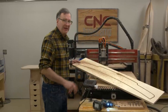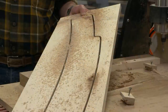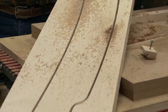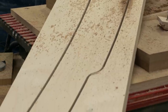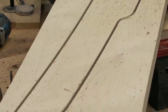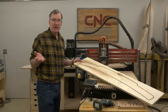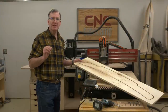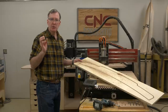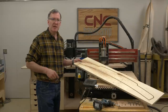There we go — there's our crest rail in three pieces, tiled on this small machine. It's an easy process and it really allows you a lot of flexibility and growth with your machine. What we've done here is create a long piece, but you might also want to think about wide pieces. If you need a 4x4 foot logo, you can't do 4x4 feet, but you can do two 2x4 foot segments and then use something conventional like biscuits or splines to join the two halves together. Tiling is a fantastic way of making your little machine do big things.